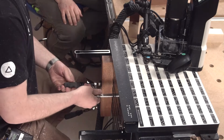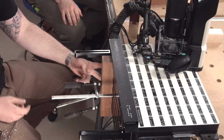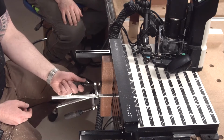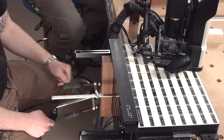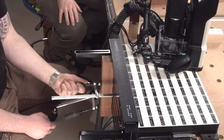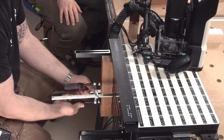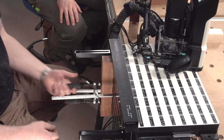So what are we using for this setup? We're using the 2 vertical locating pins on that left side of the workstation over here. What I found for best success is I want to place my first clamp between those two locating pins, and this clamp, when it exerts that pressure, is kind of pushing everything out toward the left as this thing flexes and bends away. So that's going to push that piece really well into those pins, and then lock it into place with that lower clamp.